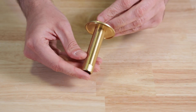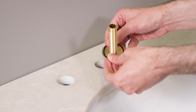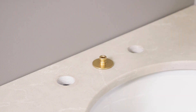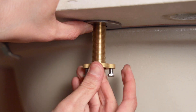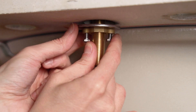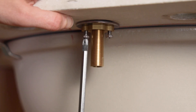The first step is mounting the spout shank — that's the threaded brass port that receives the spout. You'll notice that the spout shank has a groove on the underside of the flange for an O-ring. Place the O-ring in the groove and then fit the spout shank into the center hole of the sink or deck. Make sure the O-ring stays in the groove when you mount the spout shank. From underneath, place the large metal washer over the threaded shank and then spin on the mounting nut with the jack screws. Position the flat side of the washer towards the sink basin. Snug the nut and washer as tight as possible by hand and then tighten the jack screws evenly with the Phillips head screwdriver.